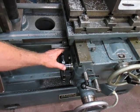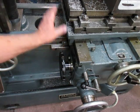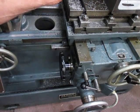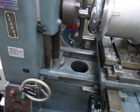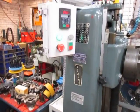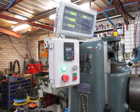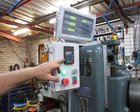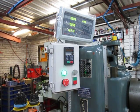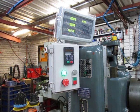We're not using the coarse hand wheel — what we're using is the fine hand wheel. It has markings for per thou, and I'm feeding it by hand, moving it a little bit for every turn of the cutter. Up here we've got the control center mounted on the Kearns: stop, start, emergency rheostat, the controller for the unit inside, and our electronic measuring stick.